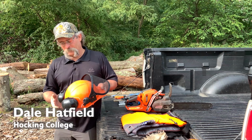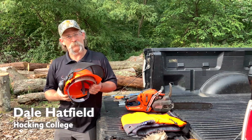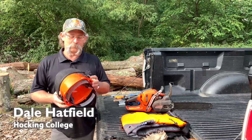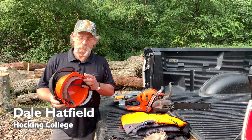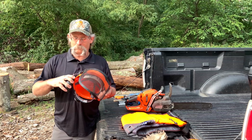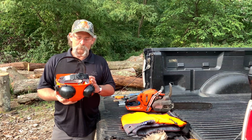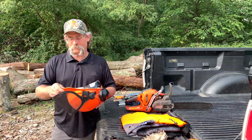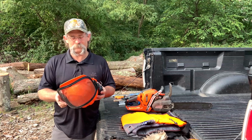I want to talk to you a little bit about chainsaw safety and personal protective equipment. First thing on my list of items that I want to wear when I'm operating a chainsaw is a hard hat with a full face shield, earmuff protection, and the hard hat being in good shape, something that's not very old. A hard hat has a very short service life.